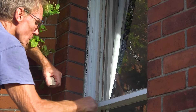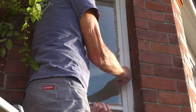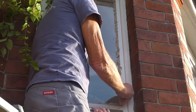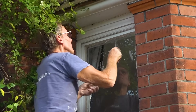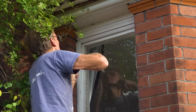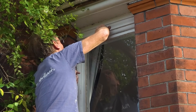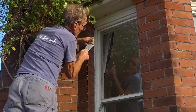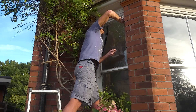It shouldn't be above the line either, because if you look from the inside out you'll see a ragged putty line — so it's a question of just getting it right. It's really one of those jobs that's easier to do on a bench, but just keep going until you get a nice smooth line. It really does help to have a spotlessly clean putty knife. I'm using a chrome plated one here, but make sure there's no filler or dirt on it. Polish it up and you get a nice smooth line, and I finish off with a straight filling knife just to flick off the excess and make a nice straight line.